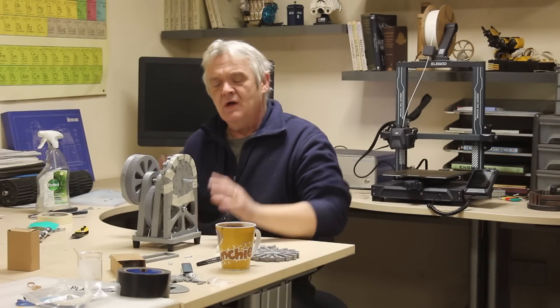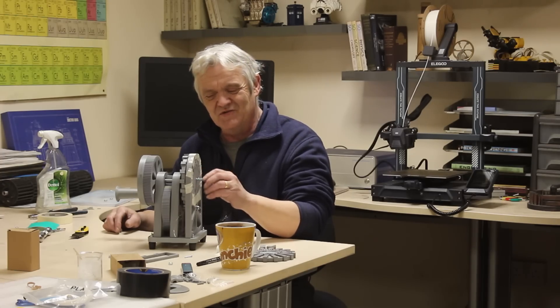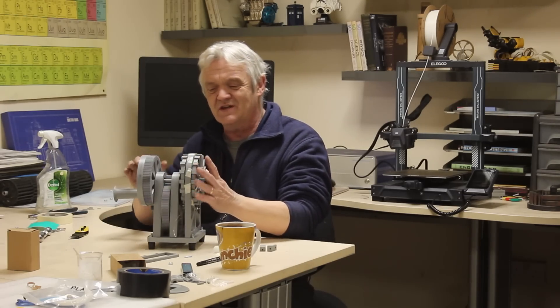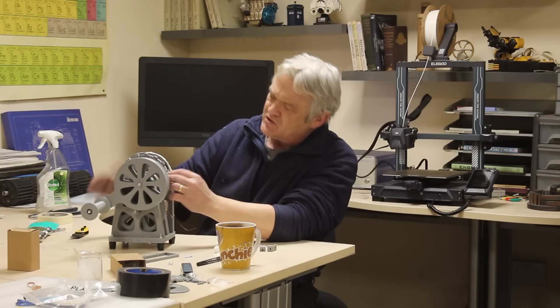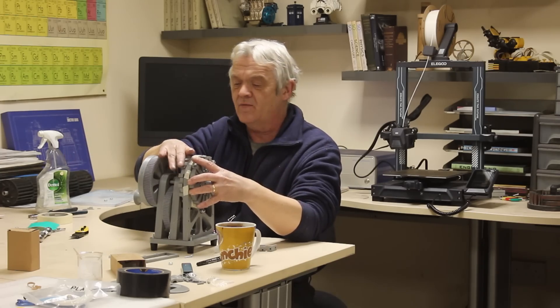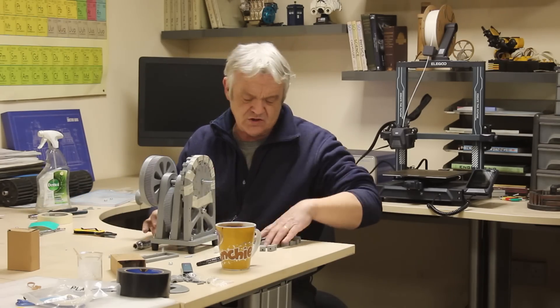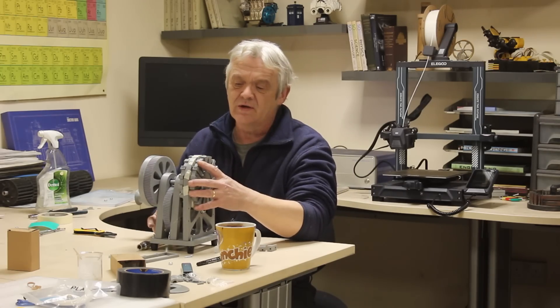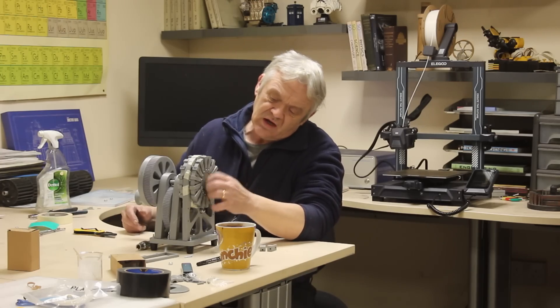That's it wired up. This video is really about the mechanics of building this, since there were no instructions. If you're wondering about three-phase wiring, I've done about three or four videos on that already. To finish, we slot the second rotor disc on. I've put an alignment mark — a black mark — on both rotor discs so they line up north-to-south, because the magnetic field goes across that way, which is what makes it an axial flux generator. Put a couple of washers on so it doesn't hit the stator, then a nut goes on and we tighten it using the hex on the rotor.